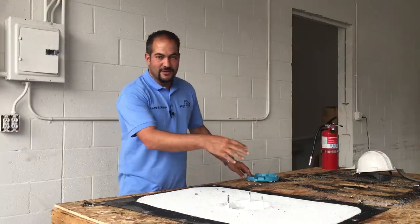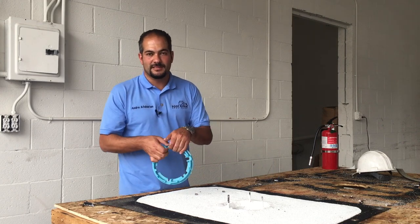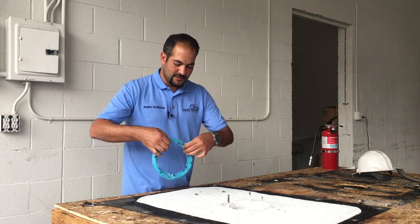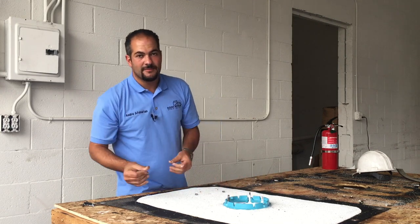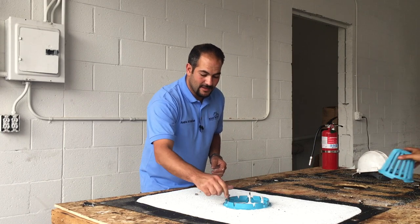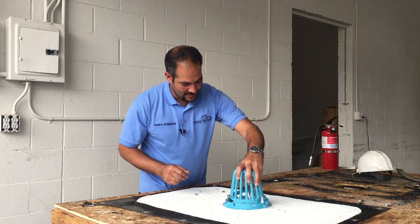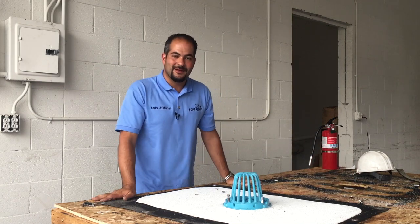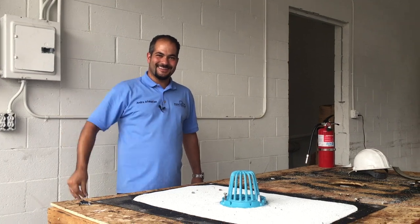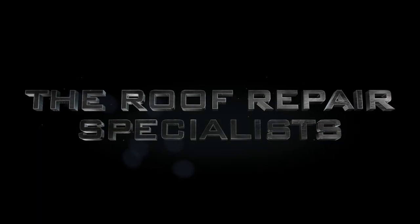We've got our drain installed and sealant applied. The last step is to install the drain clamp. You can see these three bolts sticking up — generally they'll be down a little bit further. This drain clamp just sits on top; usually we wait for the sealant to dry so that whenever it's time to remove the drain clamp in the future it can be done easily. The bolts get tied on and the cover gets installed, and that's it — that's how you properly install what we call a strainer drain, or downward drain. I want to thank Chicho and Jose for helping me today. Tune in next time for more videos and subscribe.